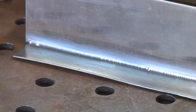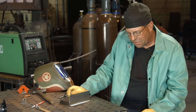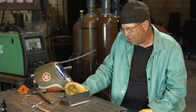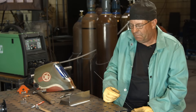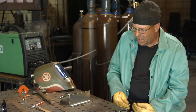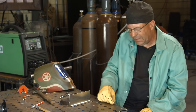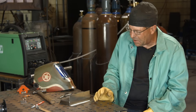Came out pretty decent. I believe the other question was dissimilar metals in the same fashion. It would weld essentially the same. If you're going to do dissimilar — I'm assuming dissimilar would be carbon steel to stainless steel — you're going to use a 309L stainless on that. More than likely, I would anyway, and it would weld exactly the same. You do not want to use a carbon steel filler wire if you're doing stainless to carbon. Always use a stainless filler. You've got to take care of the stainless alloy.